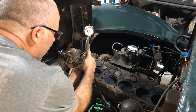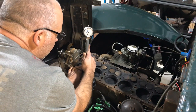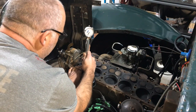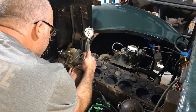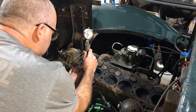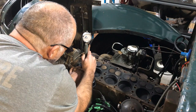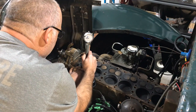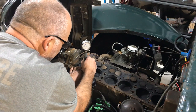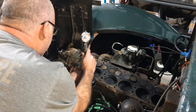I'm going to drop below the ridge and you're going to see the gauge move. This is the cylinder wear below that ridge. The lowest number I can get is 13 and a half thousandths of an inch of wear in that cylinder from when it was new. Going midway down I get about 3 and a half thou. All the way to the bottom, just up a little bit from there, I got 4 thou.